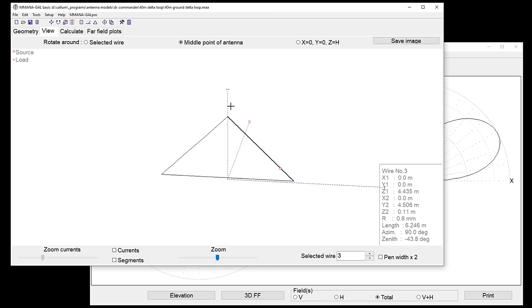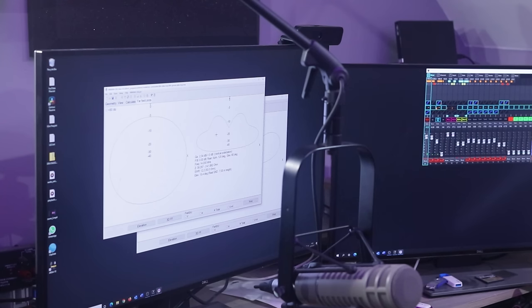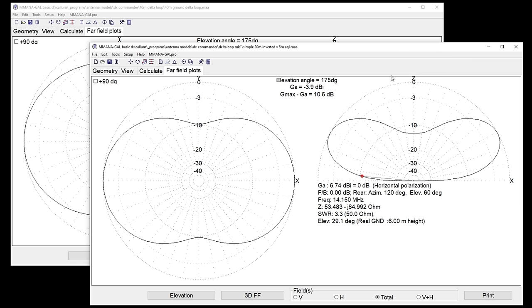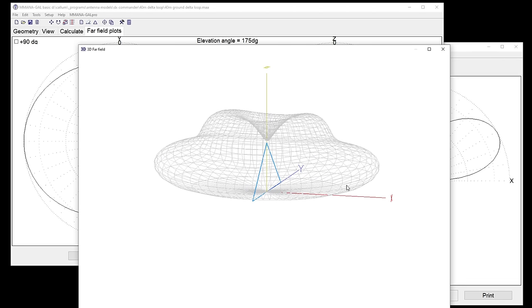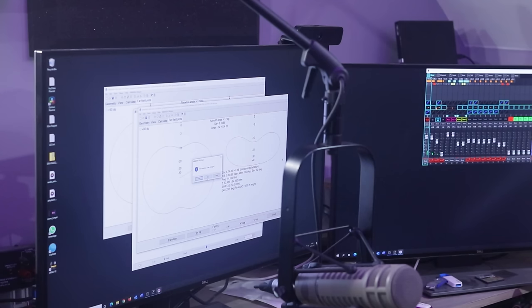What about feeding it at wire three — about a quarter-wave down from the top? Now it's vertically polarized — this will look a little bit like two phased verticals. The result: minus 1.9 dB. So actually if you get the height you'd be beating the dipole — interesting, nice-looking plot in a weird way. But that's a mono-bander. To be honest it's our dipole equivalent. I digress — let's move on.